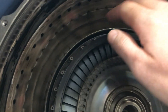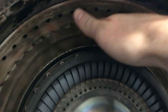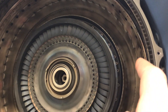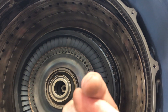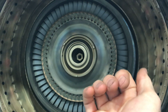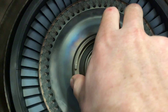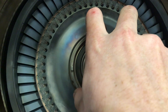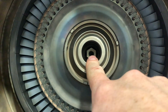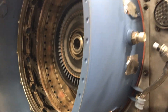Fuel and air get ignited and the burned exhaust moves rearward toward the back of the engine. It gets burned, goes around the corner, then comes back the other way. On the other side of this wheel is the stator vane — a set of vanes that direct the superheated exhaust into the turbine blades, spinning them the correct direction.